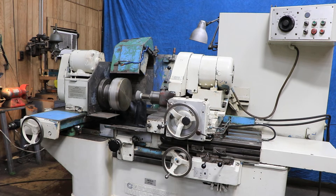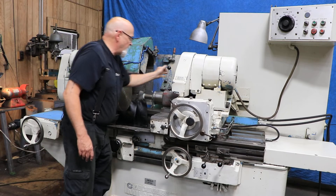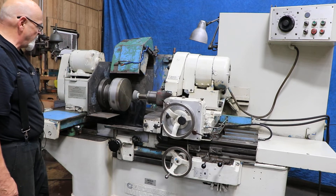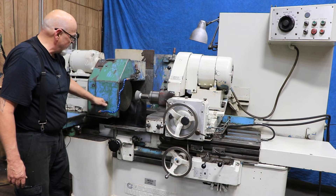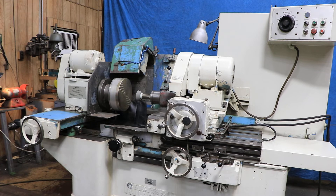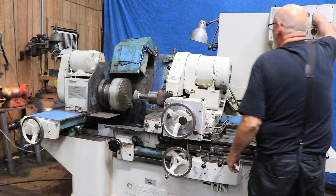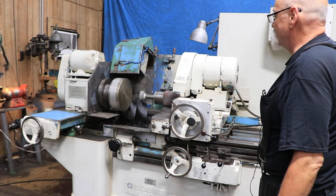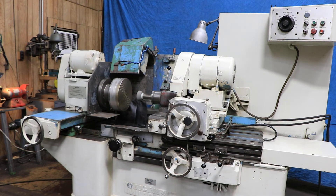The machine is currently wired for 440 volts. You have your Heald fold-down dresser back here — you bring this down and you can dress the wheel either by hand or you can set it up to do it under power. You have a hood that comes down over your workpiece, keeps you nice and dry, safe. That's pretty much everything — I think I covered it all. Let me turn the grinding spindle on. That's the Heald 273A. Thank you very much.